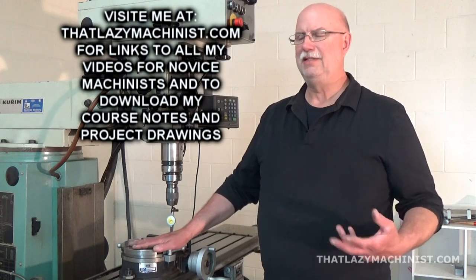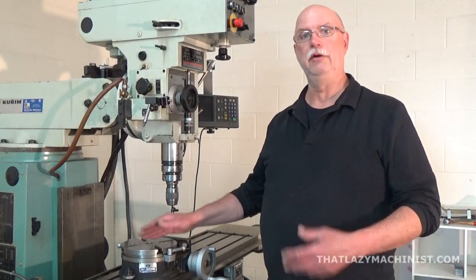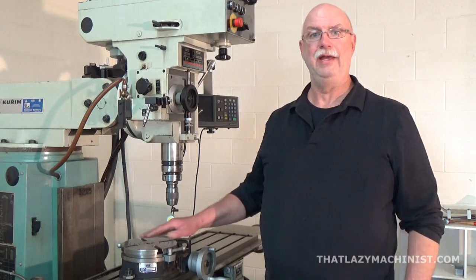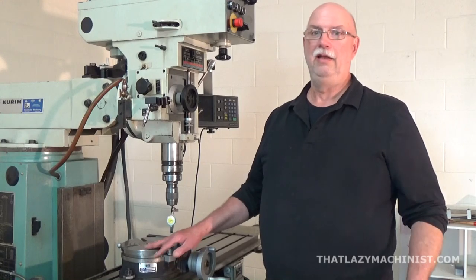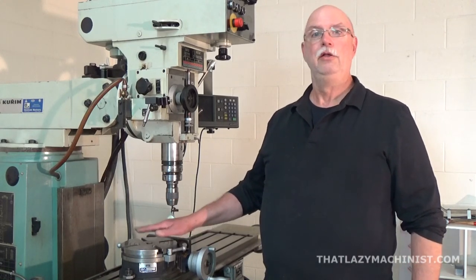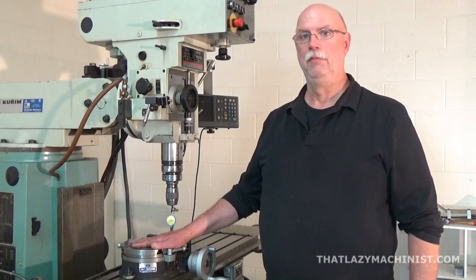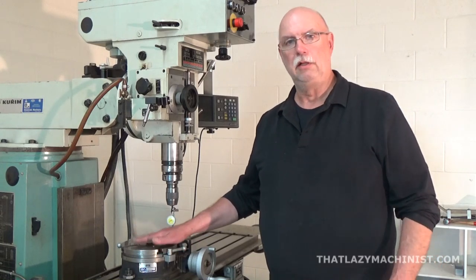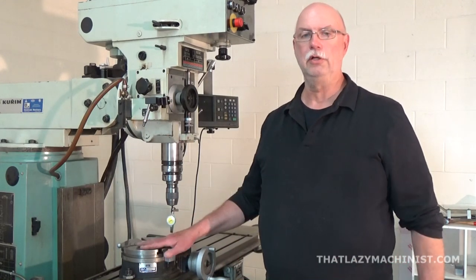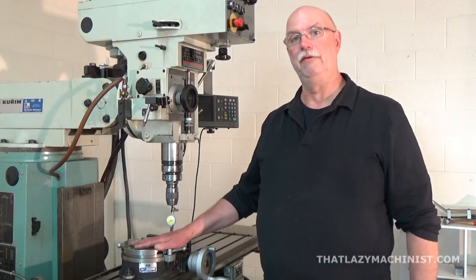There are three basic needs for a rotary table. The first is when you want to cut a specific angle — we use the rotary table for angular cuts when it is a bizarre angle and our traditional angular setup tools just don't work. Let's say we want to set up for a 20 degree, 20 minutes, 20 seconds angle. That is an odd angle.